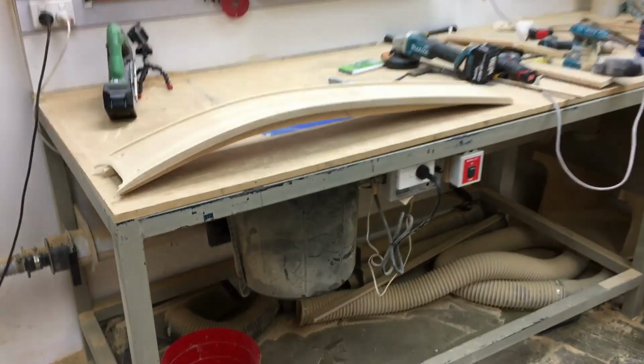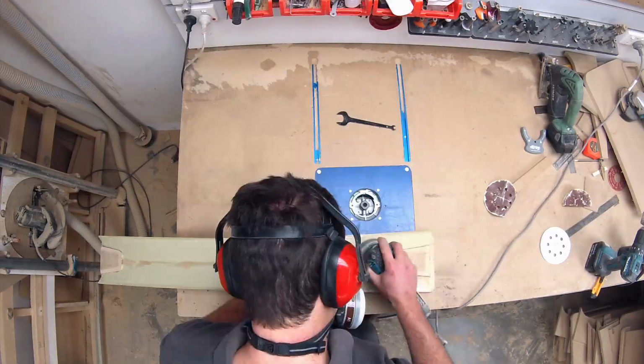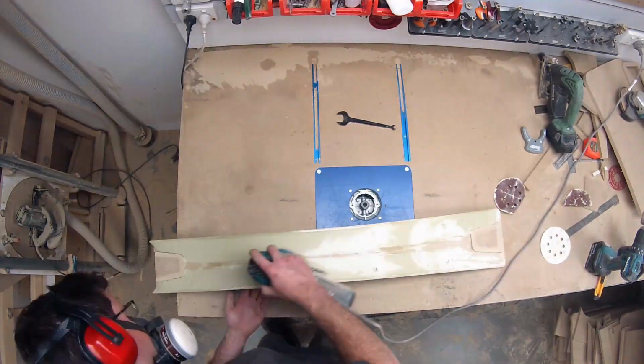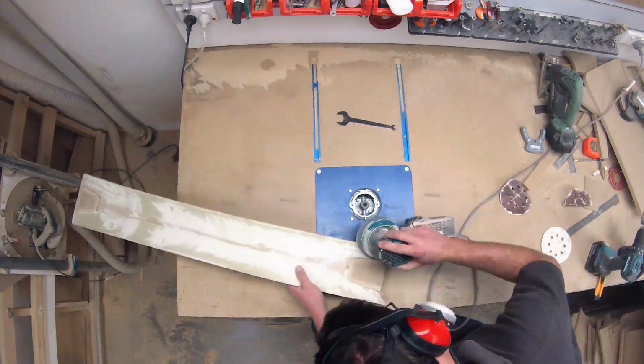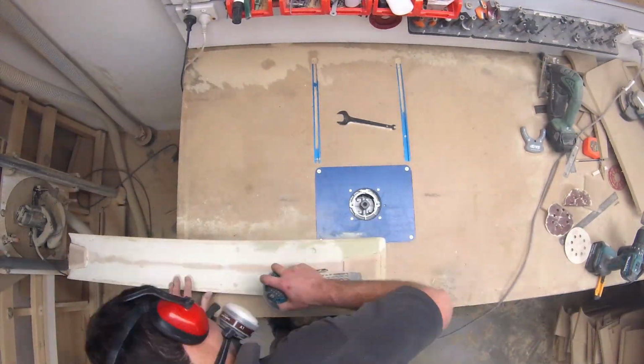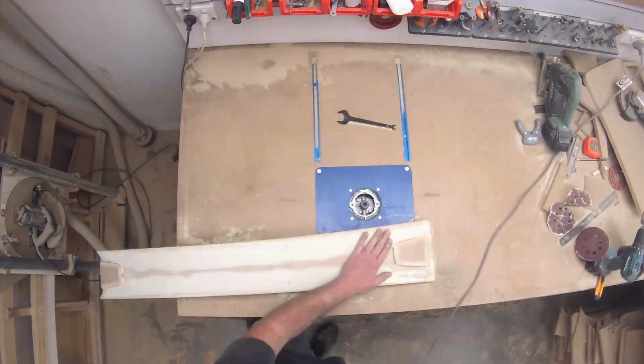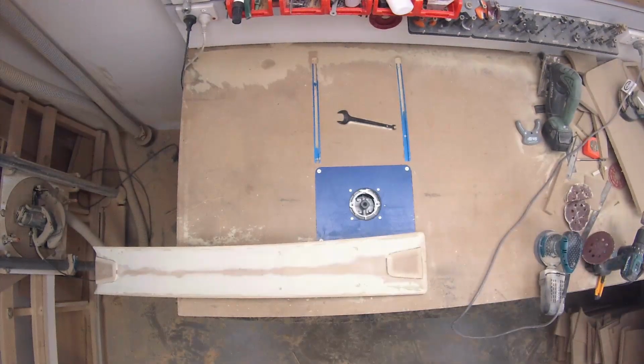And here's the piece with the 6mm strips glued on there, ready for applying some body filler and sanding that to shape. You'll see that I've also added some little pieces to the front and back edges. And I think those sort of details just really set a build like this off, giving it a bit of shape rather than just curving a flat piece of MDF and calling it good.